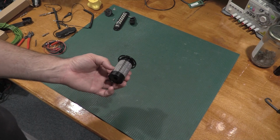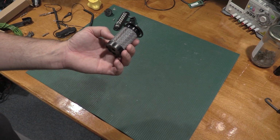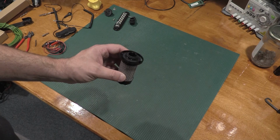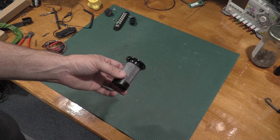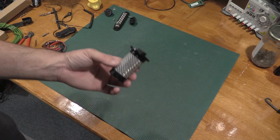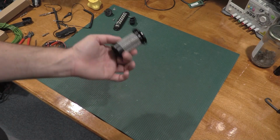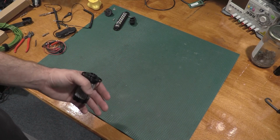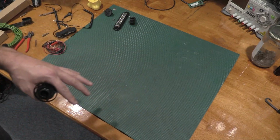This is to take out the solvents, things like that, because the N2 filter is sensitive to solvents. Given that my air compressor is in the dirty side of the building, I took a lot of precautions cleaning up the air before it hits the bench. Now, all the bench air goes through all the filtration. So when I'm using the air gun on the bench, all of that comes through this filter as well. There's a 3-stage and then there's a 4-stage air filter before it gets over to the bench.